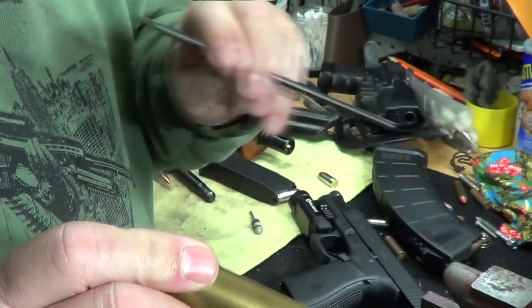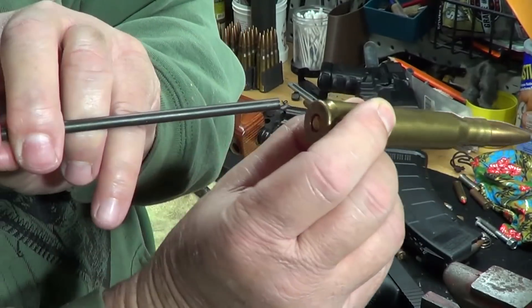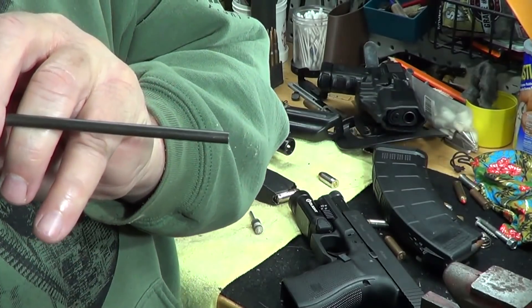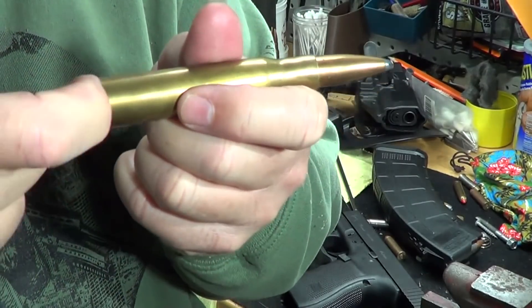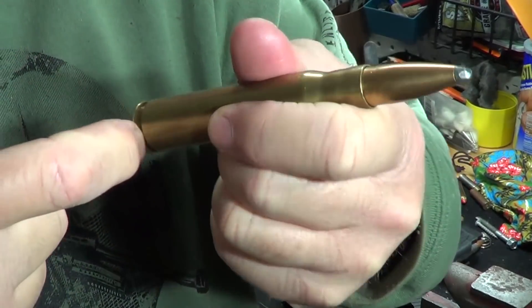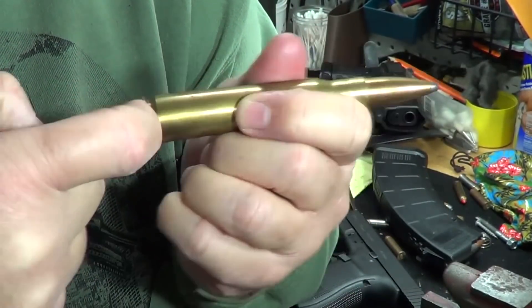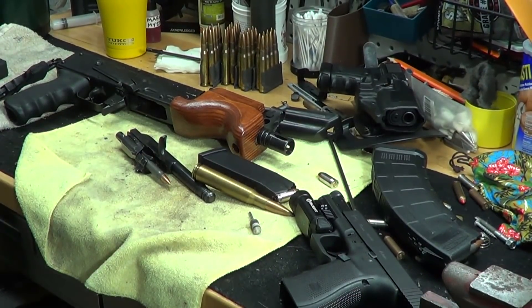Your ejector is normally a big piece that your extractor pulls the round into, and when it hits it, it spins the round out and away, releasing it from the extractor. You notice when the extractor is hooked and pushed out, it bends around and is released — it's not designed to take that impact. I think I beat that dead horse to death, but I was surprised at how many people didn't know that.